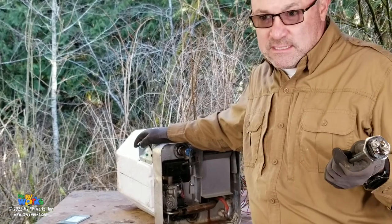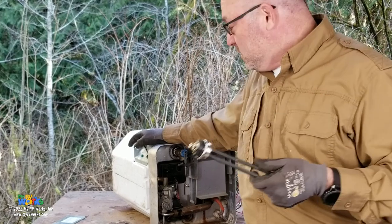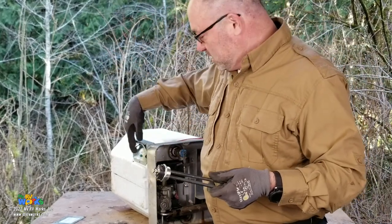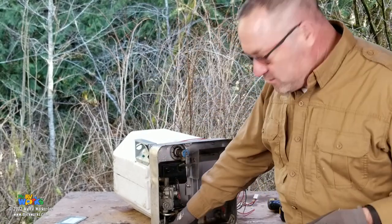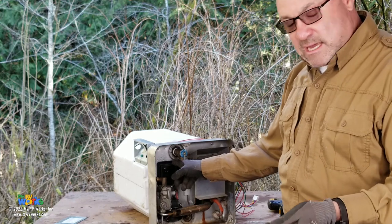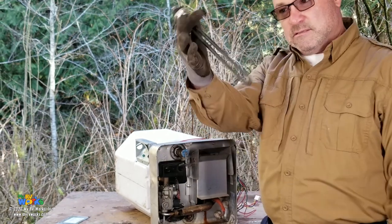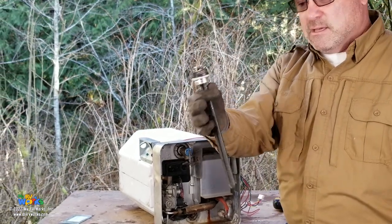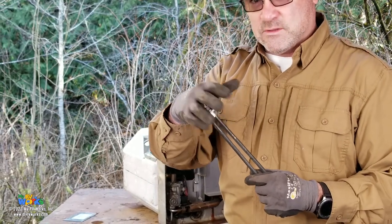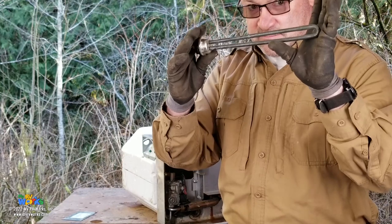Doesn't mean that it's never going to happen, but it leaves a breaker box, may or may not go through a switch on the inside, comes through this junction box, goes down to the switch, which is an on-off switch, then it comes through the thermostat, and then it lands on my heating element. And this is one of the things we're going to do on that other video. We're going to show you how to test these things with Ohm's law, Watt's law, and all that kind of stuff. Okay?